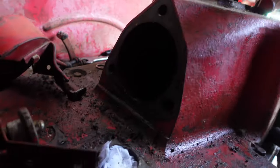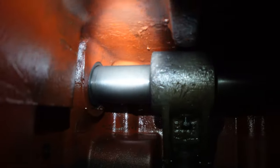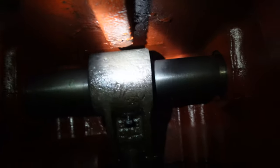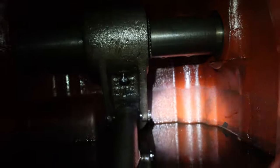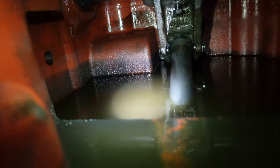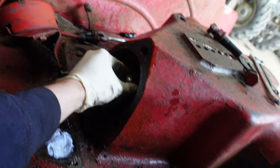So if I take you on a little journey inside the oil reservoir underneath the seat pan, we can see the piston — well, the ram that attaches to the piston into the oil there — and the tubular bar is what goes and joins onto the lifting arms at either end with the splines on. All it does is the piston pushes that bar to the back of the tractor, and as that does that it lifts the arm up. So that's the receiving end.